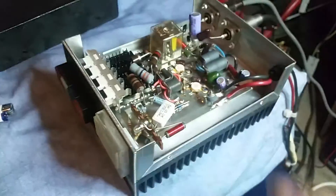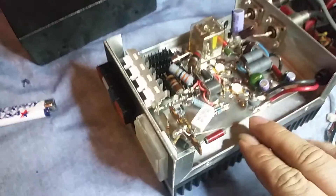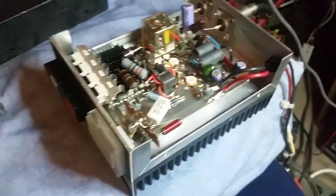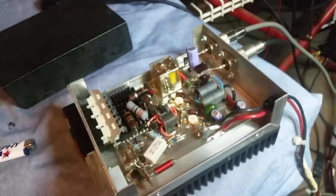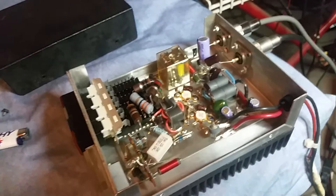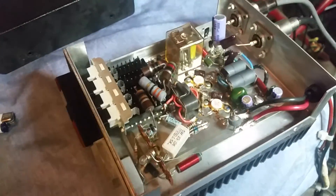That shows you the gain characteristics of Motorola transistors. Those transistors would not perform that way if they didn't have the gain figures — they would just cut off at saturation. Even with that much drive and voltage, it still would only have sat at the 200 watts it was doing. Instead it's almost at 200 bird RMS, peaking at 400 watts at 19 volts.